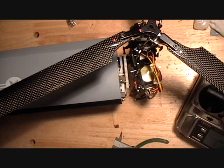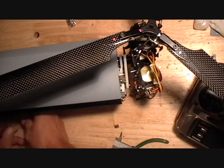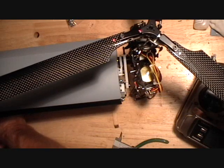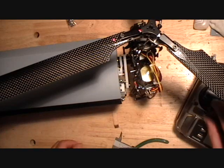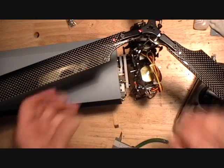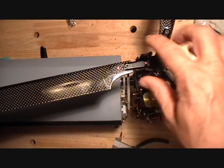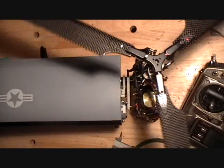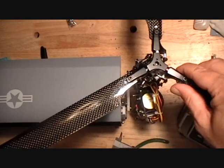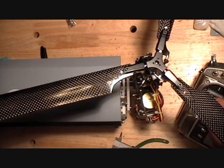The first part of Section F is tracking your blades, and I think I've found a way I like a lot better to track my blades. What you can do is just pull your blades out so they're straight out of each grip — get them as straight as you can, making sure they're coming out straight from the blade grip. Then you can actually just look at the blade on end.